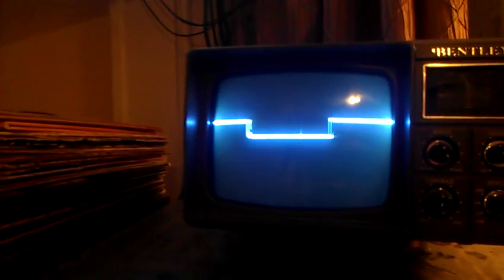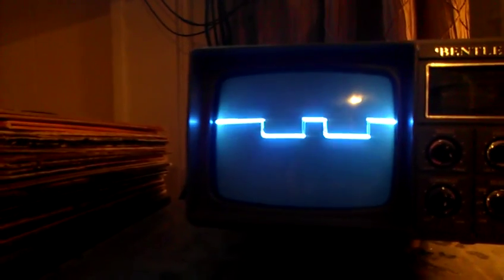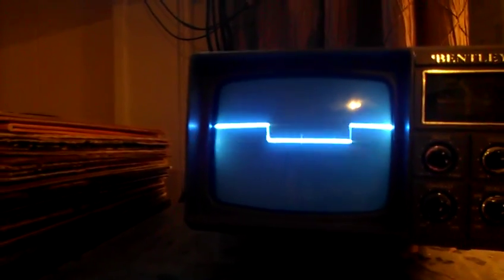This is the wave being generated by this Arduino Uno. I built the wave — it goes high for 1/1000th of a second, then low for 2/1000ths, then high for 3/1000ths, then low for 4/1000ths, then high for 5/1000ths, and then low for 2/1000ths.